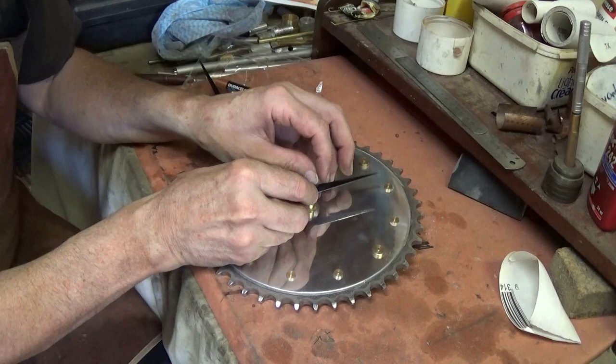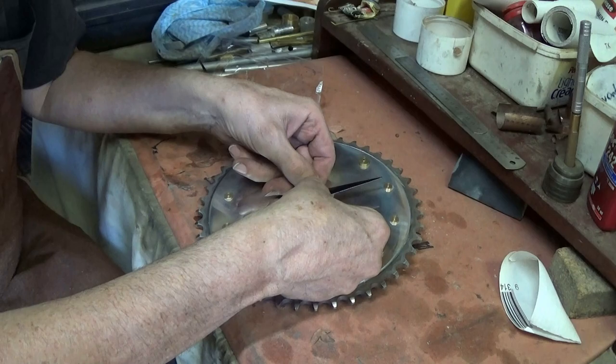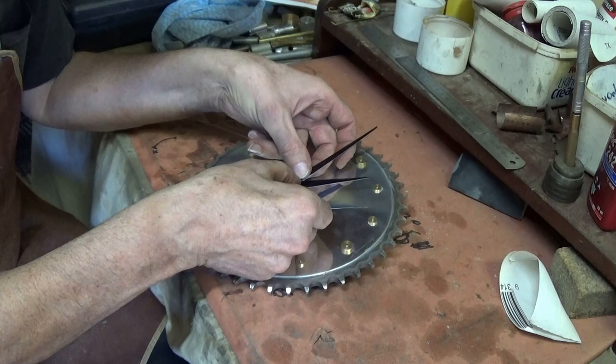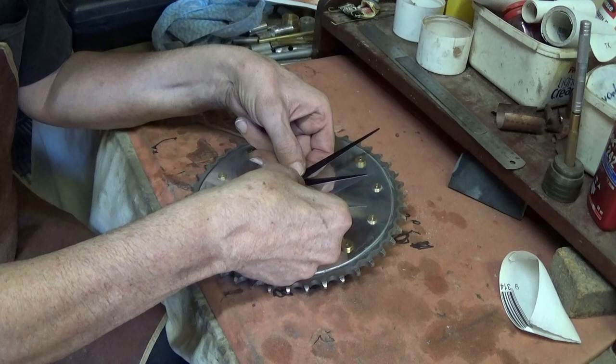The hands just press into position. They're very lightweight and very fiddly, so it's very easy to bend them accidentally, so got to take a little bit of effort to just do this right. Okay, so there's the hour hand done. Time for the minute hand. Goes on the next graduation up. Yeah, it's got to be aligned very perfectly for it to slide down into its little position. Okay, that's done.